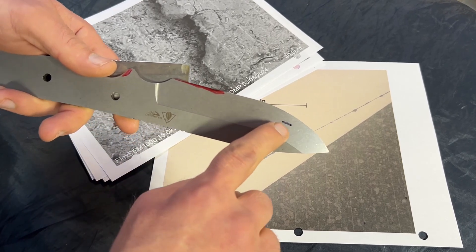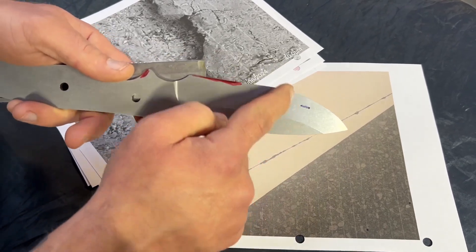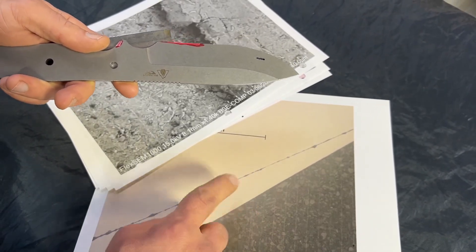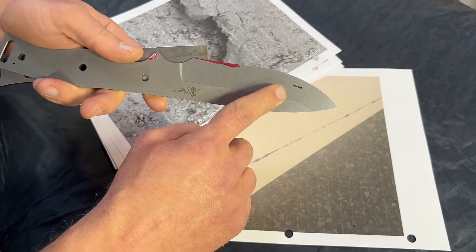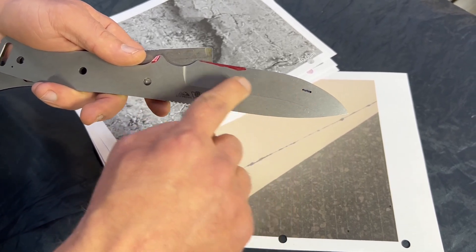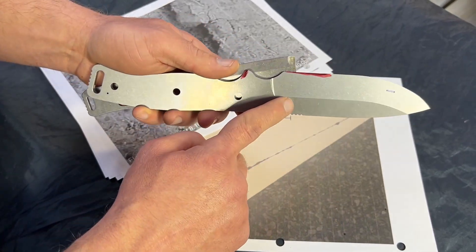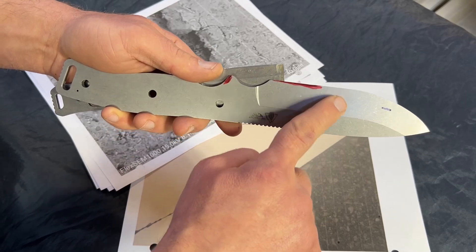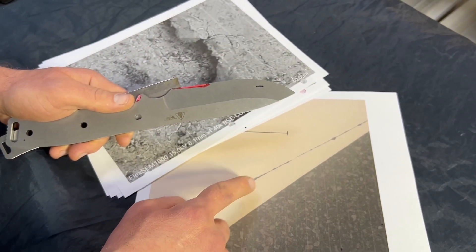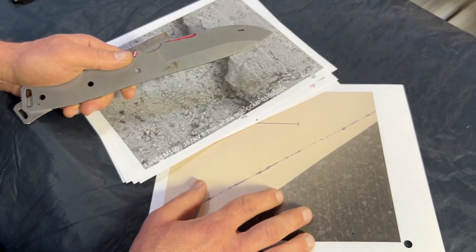You are seeing it on some of these parts from different makers, where it's a high-volume shop or that's just an acceptable standard. Where that bothers me is how wide it is in the different instances. But then I know, just looking at it from the surface grinder, how long some of these anomalies can be. And then knowing that it's just a poorly bonded pocket of stuff — that could cause a failure, and that's not acceptable. We've been averaging around 20% on what we can see visually. But then looking at it, there's always a chance that it's somewhere else in the part that I just can't see — I'm only seeing what I grind down to and how I intersect at the bevels. You don't know what else is hiding inside these parts. If I can see 20-ish percent visually, that's screaming red flags to me that there's something else going on in the sheet.